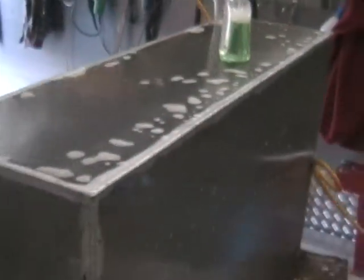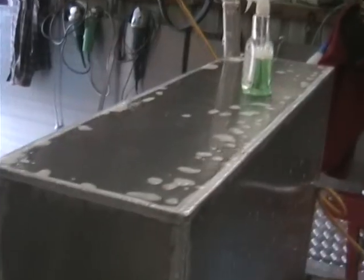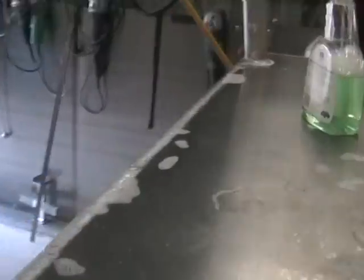It's really important to make sure you got no leaks. Otherwise, once it's in the boat and full of fuel, you won't be welding it. I'll just turn it over onto all the welds and check all the welds. I'll check them twice and make sure it's thoroughly before the tank's fitted. You only need a bit of warm water and some washing up liquid. Use the soapy water. Just make sure you get all the welds. The top of it's plug welded into the baffles. We need to make sure we check them as well.